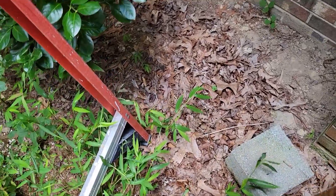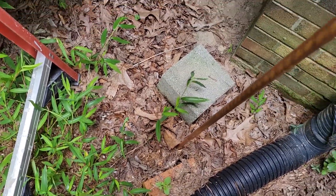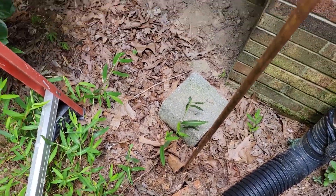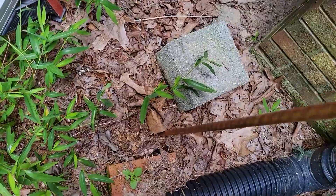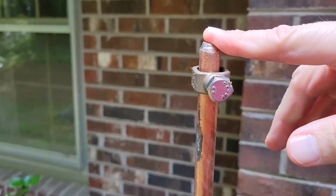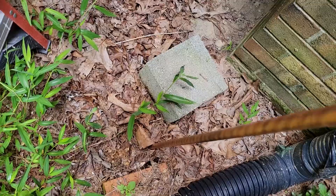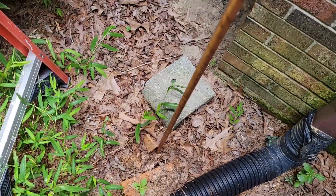The first thing I did was poke around. We've had a lot of rain here, and I'm looking for a soft spot because this area is also known for having lots of rocks. Right now I'm just turning by hand and I've dropped probably about a foot to a foot and a half, then about another six inches — all just me turning, not even using the gloves yet. Now it's at about probably five feet. So we've driven three feet in simply by hand, turning and applying no water.